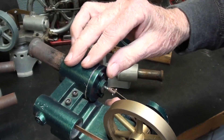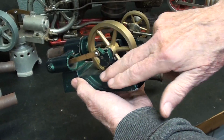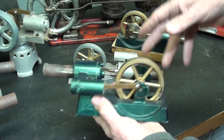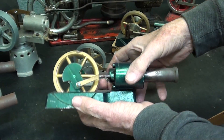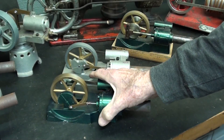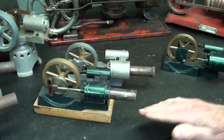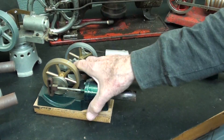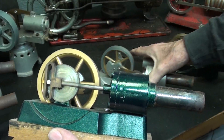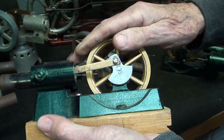This is the power piston. This is the displacer. I made some of these with castings and patterns that I used on my steam engines — that's why there is a well here for flywheels. Notice that this uses a regular crank, as does this. I was on a kick there for a while where I did some painting, though I don't like doing it. This one is elevated just a little bit on a block of scrap wood so that I had room under here for the torch or flame. But this one uses a scotch yoke instead of a regular crank.